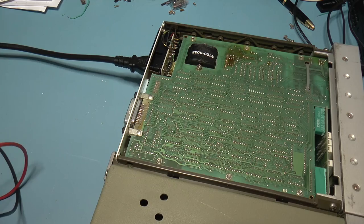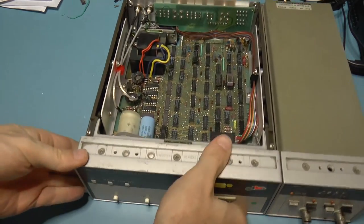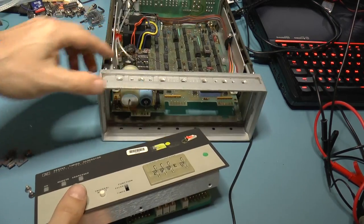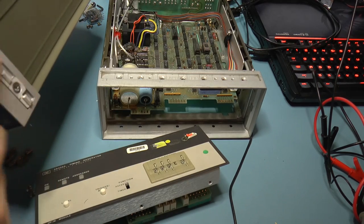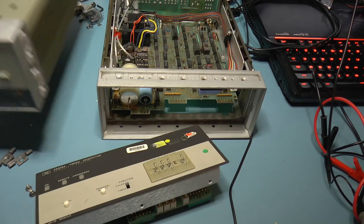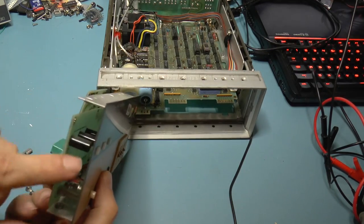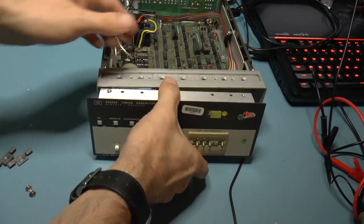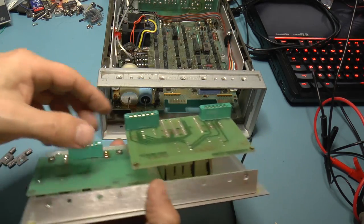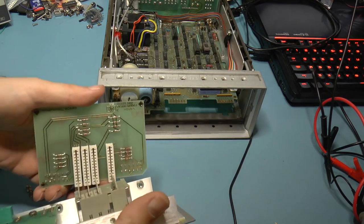So that leaves the question: why isn't this light turning on? Maybe the light is just bad. Let's take that apart. This is how the front comes off — I've removed the second unit, which was held on in the back with some little grippy things that hooked into each other on the front. There are screws on the top and the bottom. I was able to push this board out because there are just these three connectors. This board connects to the little rotary switch guys and just comes off like that.